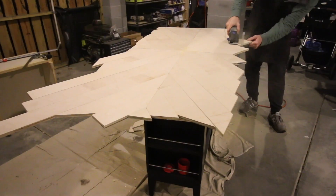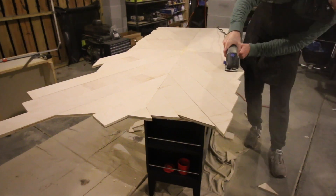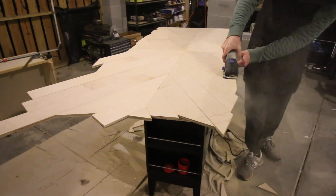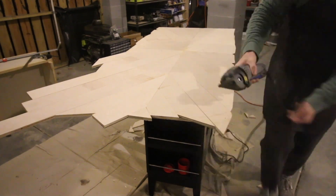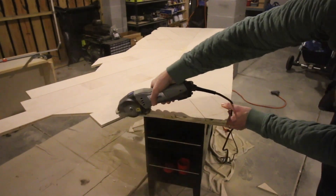We had to use a lot of pressure, so we actually clamped another piece of plywood on top just to make sure everything was flat and smooth. Then we cut off all the jagged edges sticking over the edge with a three-quarter inch backer. We started with a rough cut, then got a lot closer with a circular saw to make sure every edge was flush with the base layer.